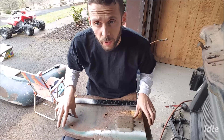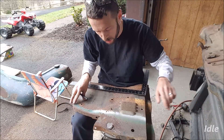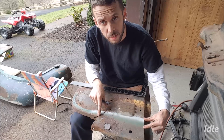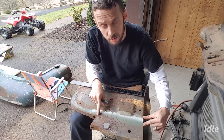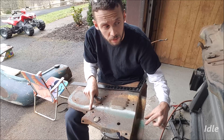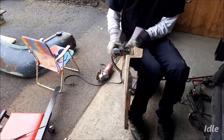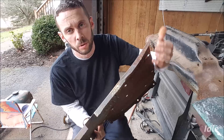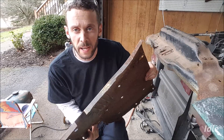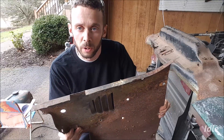Going to throw a square on right here — you can see it's pretty well straight across there from the top. This is the top of where that piece is now, so that'll give me the top point. Then I'll measure down, cut the notch out, and that should slide right back in there. Went ahead and trimmed that all down the side too, just because that was going to be too much to fight and it's really not needed. Notched that out for the cross piece — should be good.